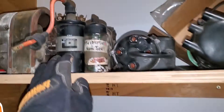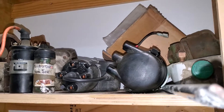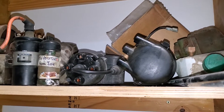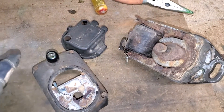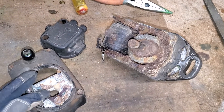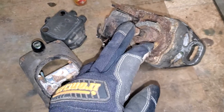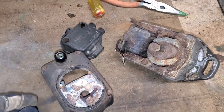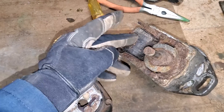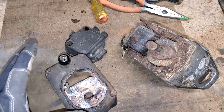I've got a coil up here with some of my old parts. This is a coil off of my dad's Model G. I'm going to go ahead and buy a capacitor, and I'm going to see if — after freeing this rotor up inside that magneto — I can just drill a hole in the case, pop the magneto coil out since we don't need it, and convert this over to a distributor.